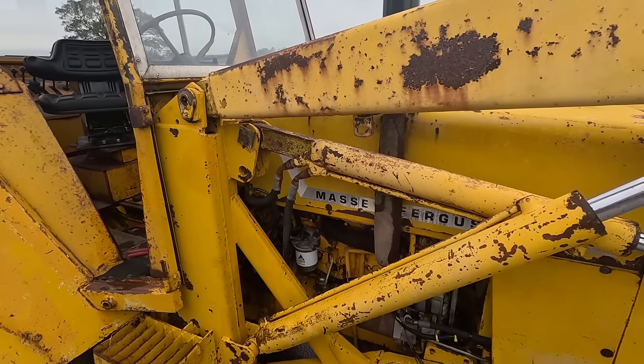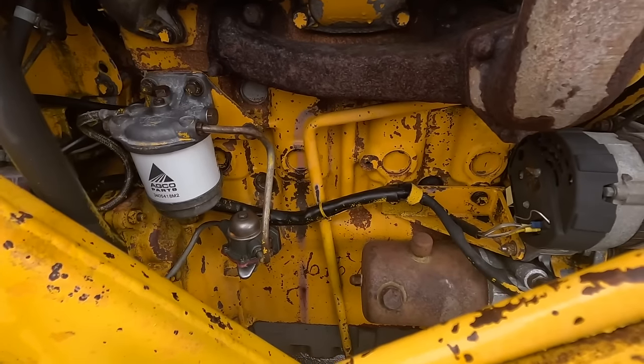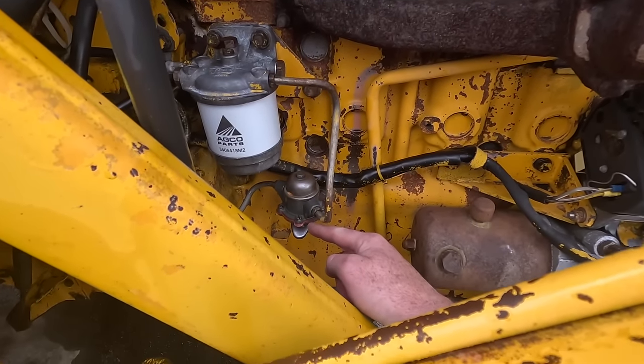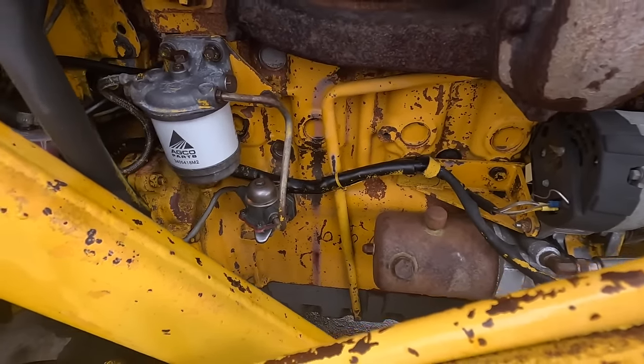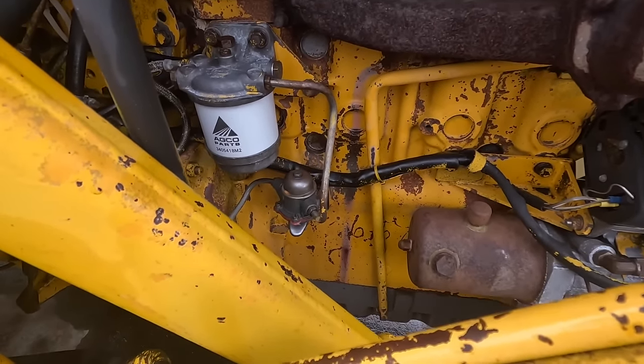She's just run there for about 10 minutes, got warmed up, and she didn't airlock — which was great. That job is done. There are also no more leaks from anywhere I can see on the diesel line. One thing I do notice — it seems to have stopped but I caught it a day or so ago — this seal here on the manual primer pump seems to be gone.